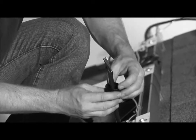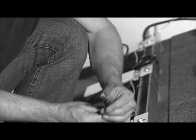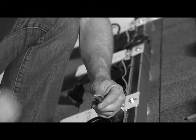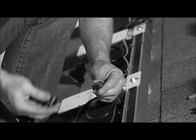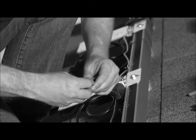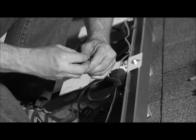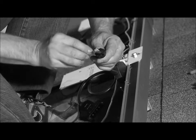Then you put on the cable gland. Next you add the sealing gasket — this is what provides the waterproof seal, and it slips over the outer cable jacket. Now you take the wire organizer, which fits with the gasket. This wire organizer enables you to take each of the wires and splay them out so that they are electrically isolated.